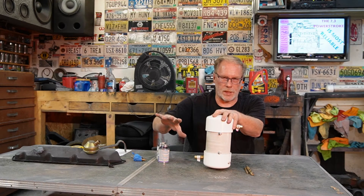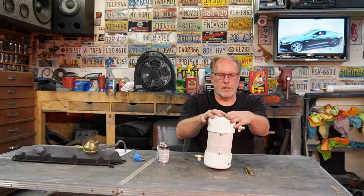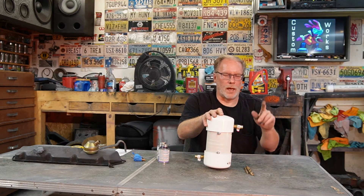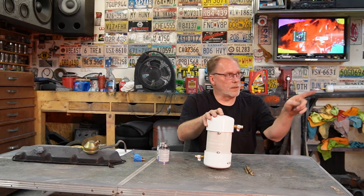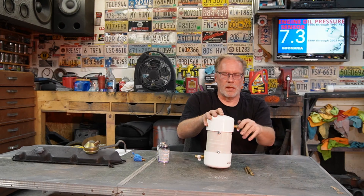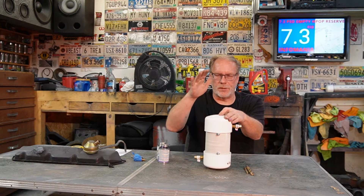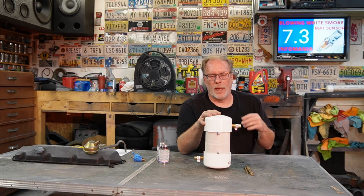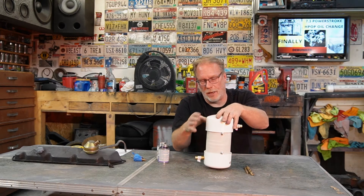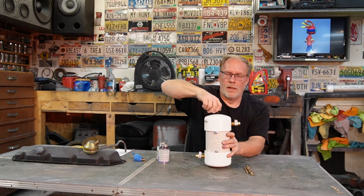Pitch the tube off towards the outside of the truck, come down through the frame, connect in here, and then you can head it off to the back wherever you want it to end. What we don't want is to have it running uphill the whole way — we want it going down the frame, somewhat level. I usually dump mine out right by the back tire. Any items inside will wedge back down to the bottom and you'll be able to drain it in the future — you can do it every oil change.